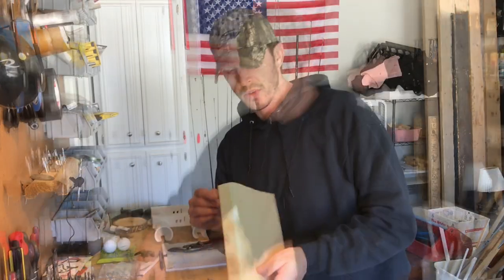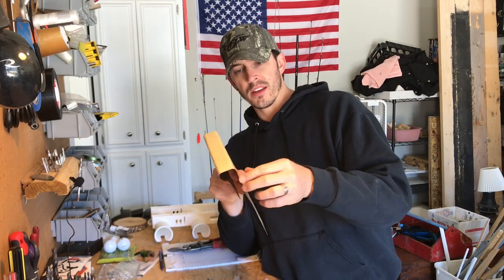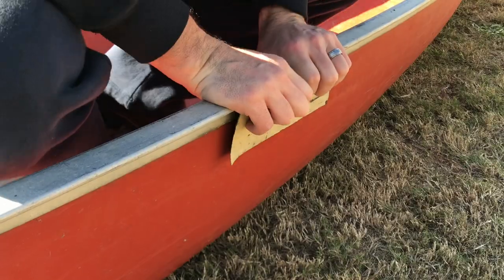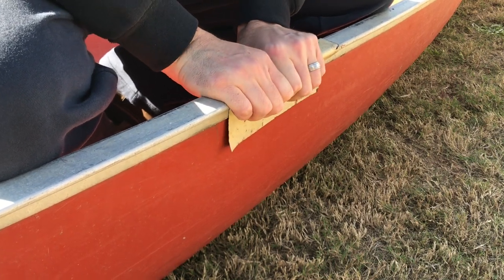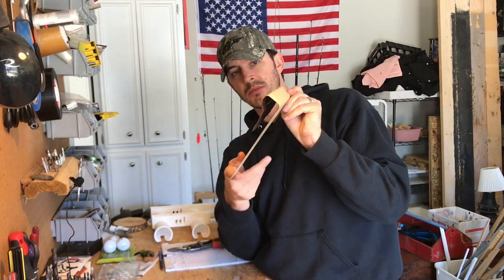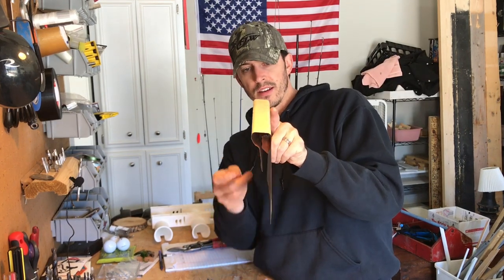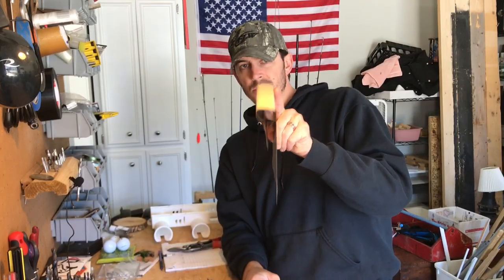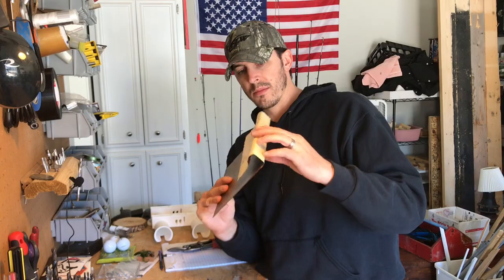For the metal bracket, I got the contour just right by hanging the flat piece over the side of the canoe and squeezing and pushing with my hands until I matched the shape perfectly. Now it basically snaps onto the side of the canoe with an extremely tight fit — you have to wedge and push it down — so it won't bounce or move, especially once the Plasti-dip coating is on.